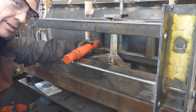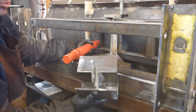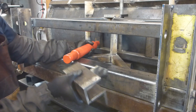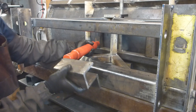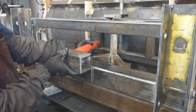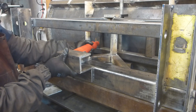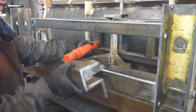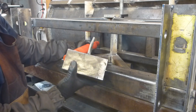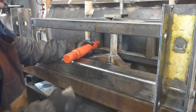Off camera — because the memory card was full — we did the bracket. Here comes the bracket, which is a pocket on each side. There will be a hole going there and there for each cylinder, and it will support the cylinder like this. It's a nice piece. It's going to be strong, it won't bend. So we need to punch holes and drill holes on both sides on the milling, and we'll be able to weld this on this tube.